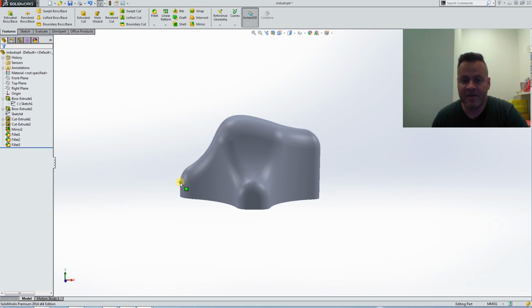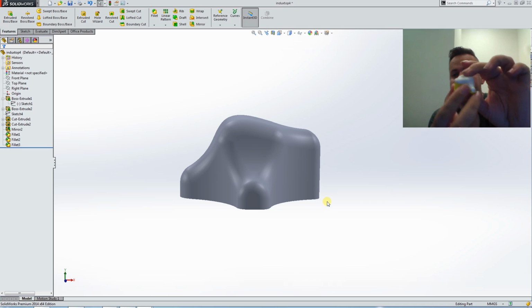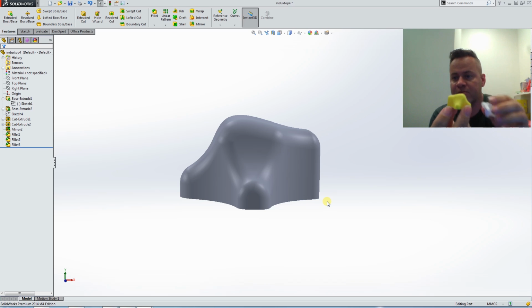Now the next thing that we're going to look at is how high this mold is, because we're going to have a cut line that's going to come along here, it'll cut down along here, and then cut up right in here. We want it longer than we need necessary, and I'll explain why that is in the vacuum forming, but essentially we're going to have a little bit of a fillet as the plastic comes up close. It's going to cool and stretch, and we're going to have a little bit of curve right here. So if we take a look at the original, this white right here is actually the vacuum formed original, and here's the mold, and you can see how much taller it is than we actually need.